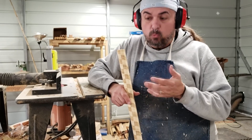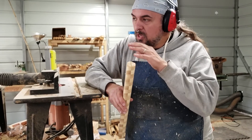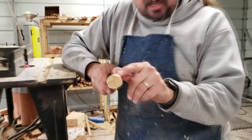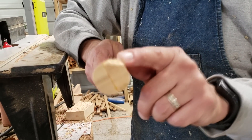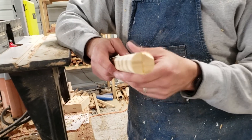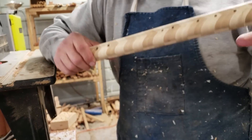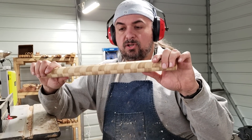I'm going to finish the video so you guys can see what the process is. One of the things I was concerned with was my planer doing this, but the roundover bit did it instead — the possibility of it throwing a chunk out like this off the end. A lot of times when you come off the end of the roundover bit, it'll throw a chunk out and cause a little disfigurement, but it only did it on one side. This side's fine, so I'm still in good hopes that it's going to be okay, and there's not a whole lot of flexion, which is my other main concern.